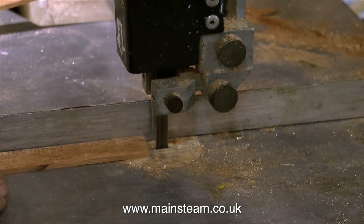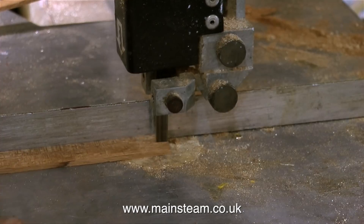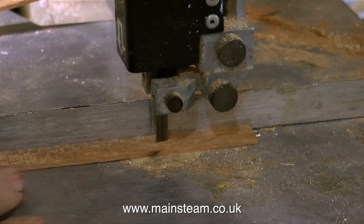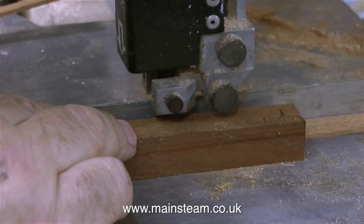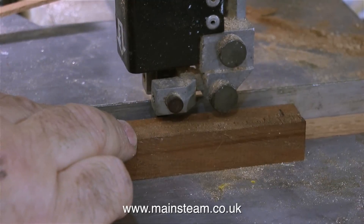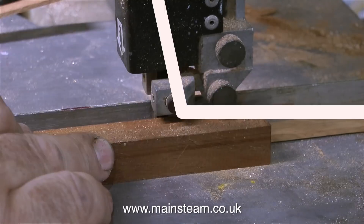A couple of weeks back I bought a lot of mahogany. This mahogany is good stuff but it's a bit too wide for this application, so I'm cutting it down using my small bandsaw. It doesn't take too long, although with this bandsaw at the moment the blade is fairly blunt. A good tip: always use a block of wood to hold the piece being cut firmly against the guide. If you don't do that it will wander about as you're cutting it and you will not get a straight edge.